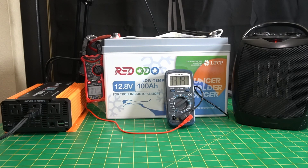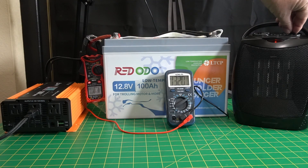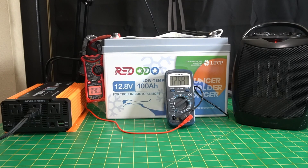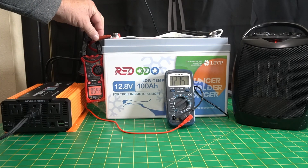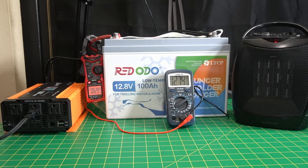We'll start this again — it's powering up. The light came on here. We'll go to the fan, and then we're going to go ahead and hit the power again for number one — level one — which peaks around 1,000 watts. Okay, so we're at 773 again — 770 — and we're holding at 12.75. That's good. And we're at 69.9 on this. These are nice little units — I'll put that in the description for you guys if you're interested. I'm going to let this run for a little while, and the next test we're going to do is throw this in the freezer and get the temperature down around zero or so and see if the low temperature cutout works. They call it low temperature charging protection, LTCP — that's up here in the corner.